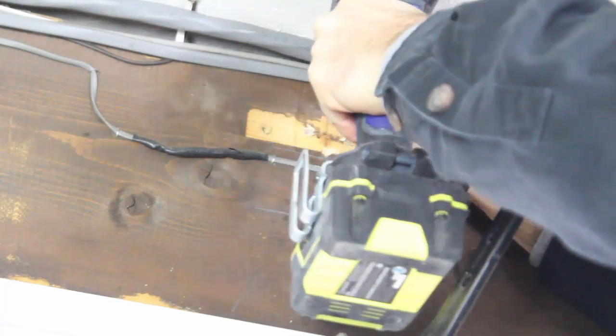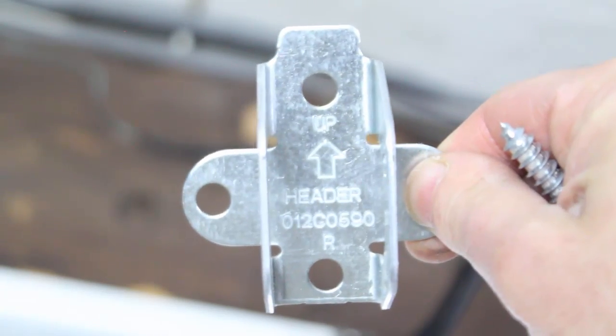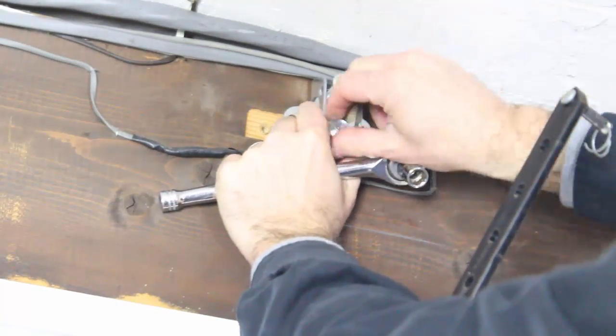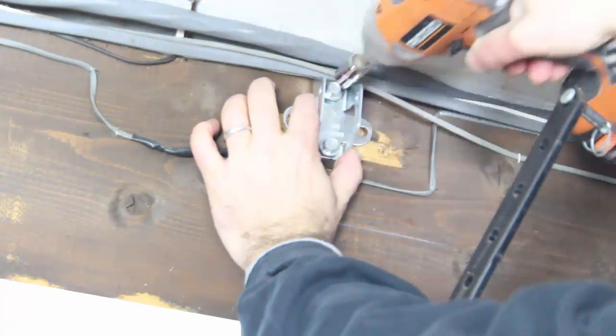Just make sure that that horizontal pencil mark intersects the center mark, or you can move it over where you want to place the support bracket. I needed to make a second horizontal pencil mark 2 inches above the first one because that's where the bracket is going to go. Mark your pencil marks, drill the holes through your header, and make sure that the bracket is facing up. Put those lag screws into the holes by hand and then tighten them down using an impact driver or socket wrench.